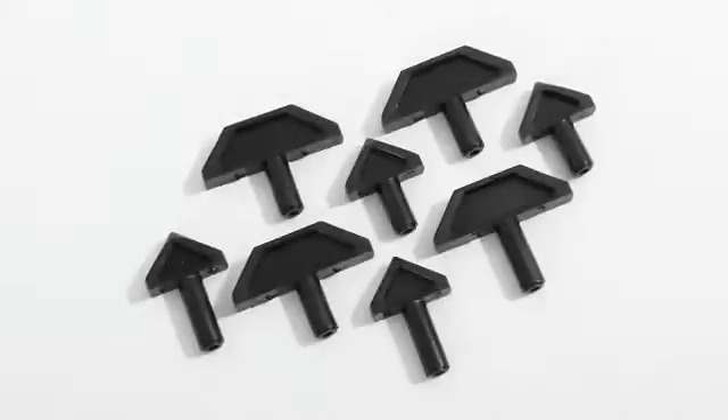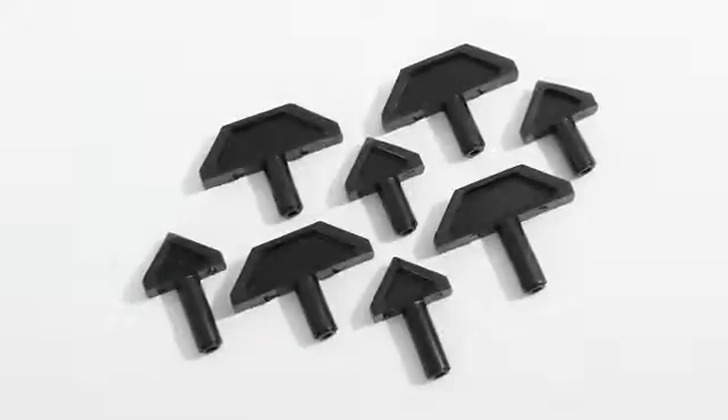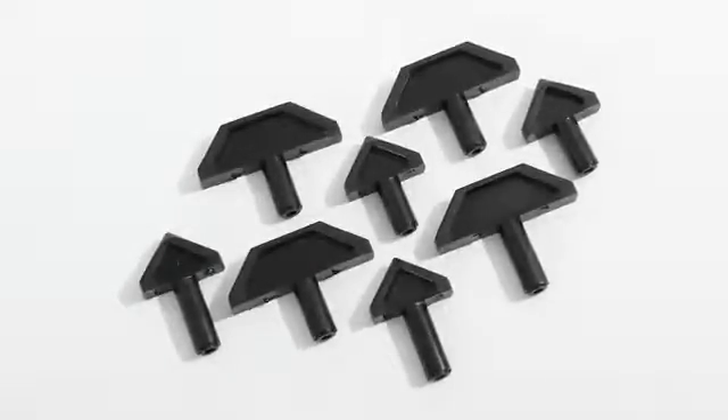The mounting pins come in four different sizes — two different head sizes and two different shaft lengths. Select the pin size that will contact both sides of the groove and has a shaft that will retract far enough to seat the Belt Hog unit securely against the sheave.